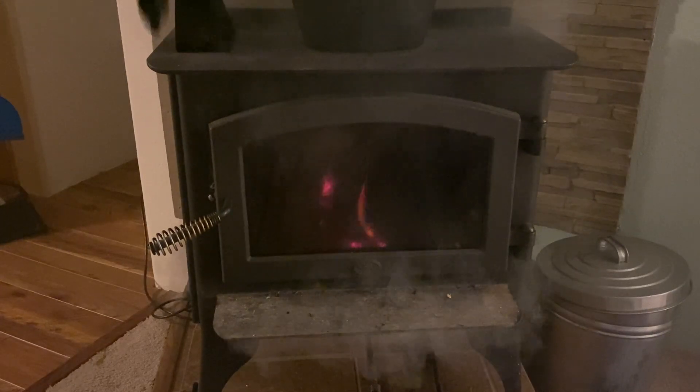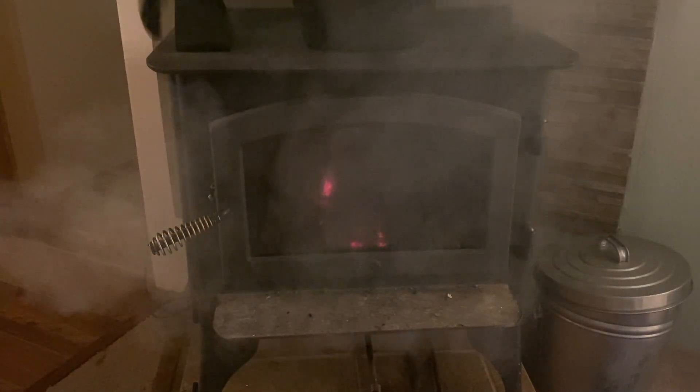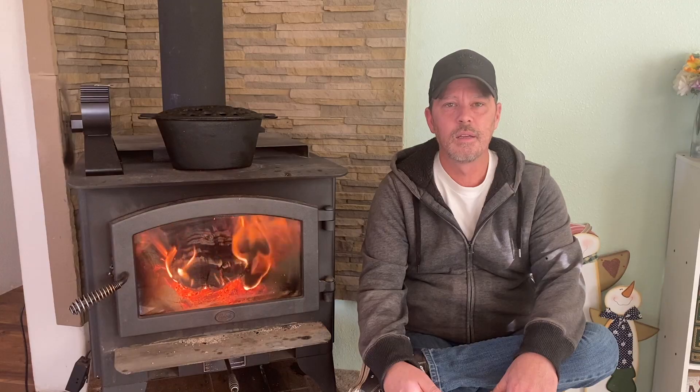If you're in a high-wind area — in our case, sometimes we get winds over 20 miles per hour — with a typical chimney cap like we have now, those high winds tend to force air down the chimney stack into your home. This is also called a downdraft, and it makes it very difficult to start a fire in high-wind conditions without smoke pouring into your home. To prevent this, I'll be replacing the chimney cap after the burning season, and I'll cover that in a more detailed video in the future.